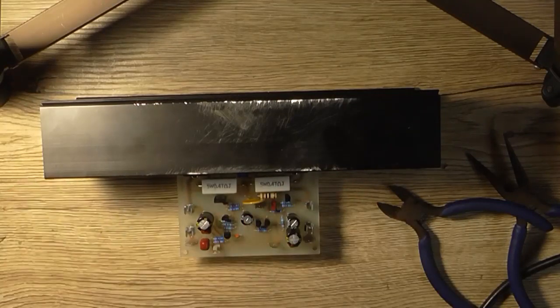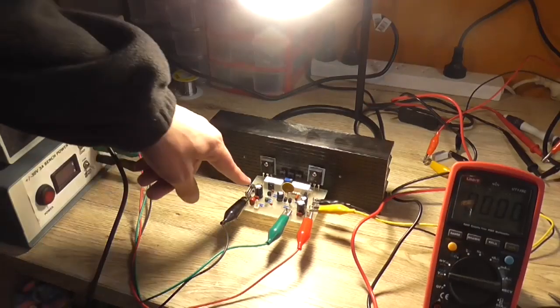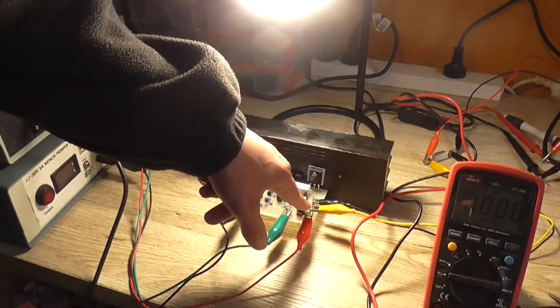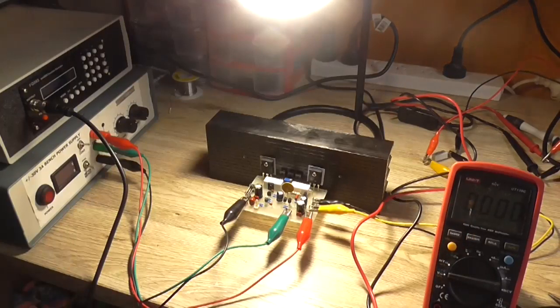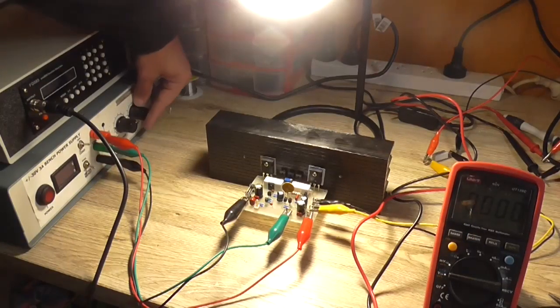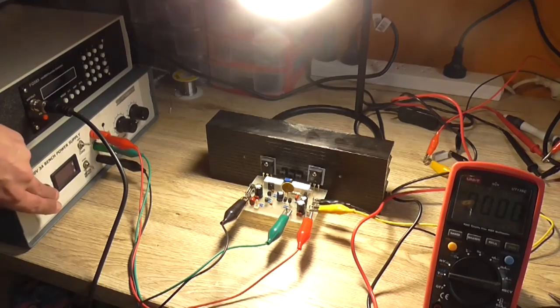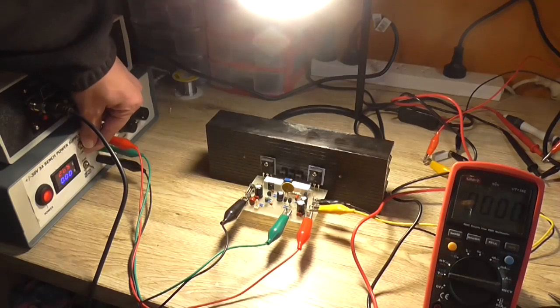So I'm going to have to pop you on the floor. Okay, got everything set up. I've got a 3 amp fuse on the negative side. Got the fuse removed on the positive side, going across a 470 ohm resistor across the meter in the voltage scale. I'm going to limit the current to around about 500 mA, just in case anything's not quite right with the circuit. And I'm going to leave it at the 25, 26 odd volts plus minus that I've got. Turn the load on.